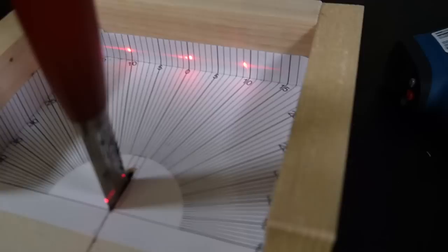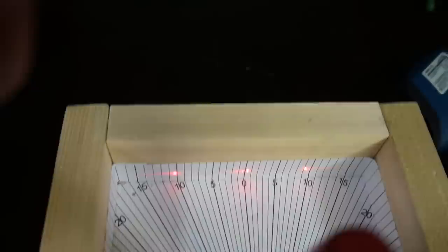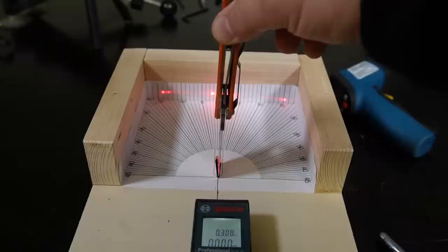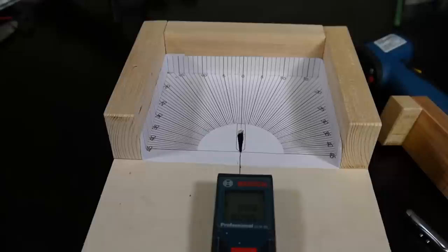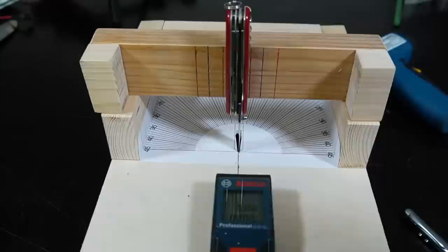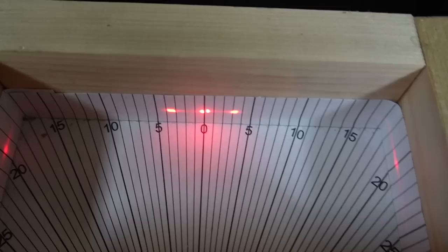This knife has two times ten degrees. As you can see, the laser ray gets split through the cutting edge — you can see it on this side and on this side. That's why you can see reflecting points on both sides. On this knife you can see four reflecting points: two times fifteen degrees and two times three degrees. Three degrees is the first bevel, fifteen degrees is the second bevel on the edge. So for this device I make a holder so you don't have to hold the knife by hand — here are magnets. This Swiss Army knife has two times three and a half degrees on the first bevel, and two times twenty degrees on the second bevel.